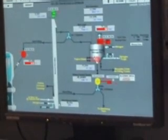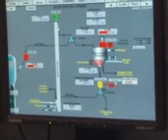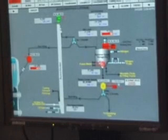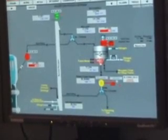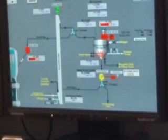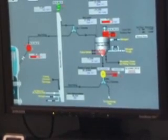Then it goes to a cooling air or storage area. We cool it, it goes to this elevator, drops into this elevator, goes up to the top of the building — 100 plus feet in the air — and goes up through a diverter valve and goes into our storage bin. Out the bottom of the storage bin, that's where we have a rotary feeder again, which goes to our dissolving tank.